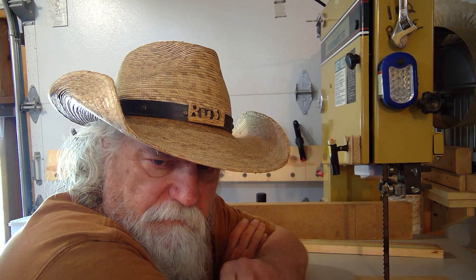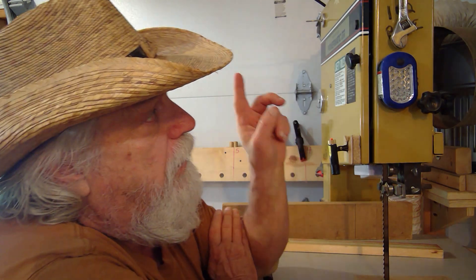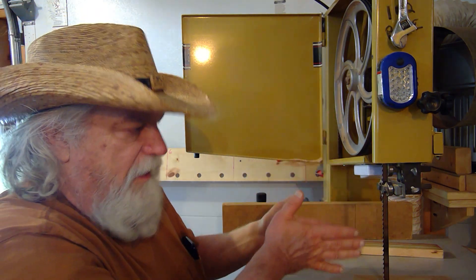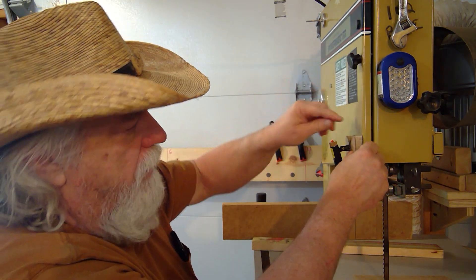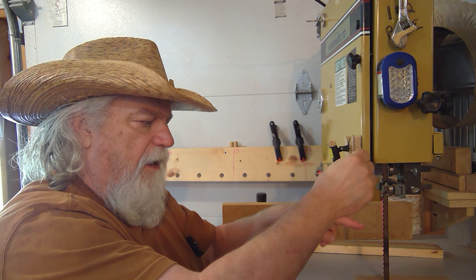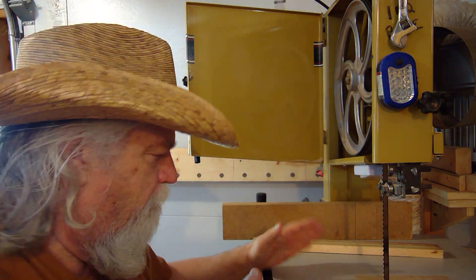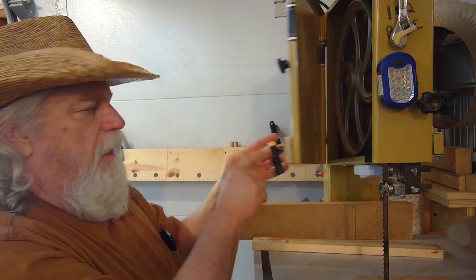Hi, Russ here. Yes, I'm back. I just got an interesting comment from Keith Short who apparently just watched my video and he had a very valid point — showing how I adjust for the band saw blade drift. At the same time I'm going to show you how to determine whether or not you can even adjust blade drift on that blade based on adjusting that wheel. Right now my blade is set to the drift that the blade is at, just a hair off center, and that's compensated for in my laser light.